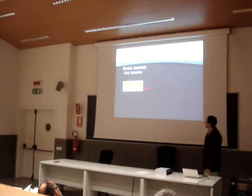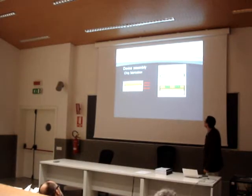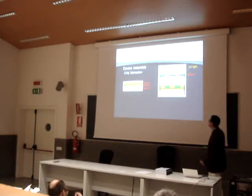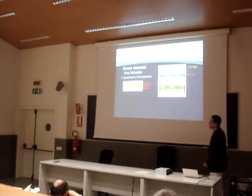As we can see, this is the wafer, this is the metal that has been sputtered, and this is the photoresist. I have used a mask for the photoresist, so I apply UV light onto the mask. As you can see, this mask has patterns on it, and all the UV light is going to enter only through the holes of the patterns. And the green light is the hardener of the photoresist.